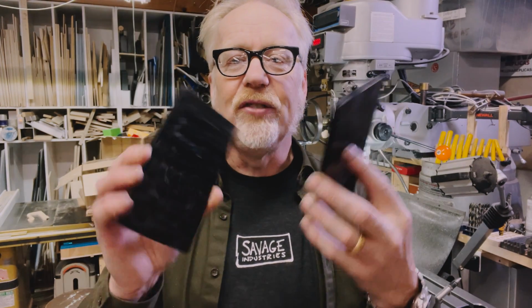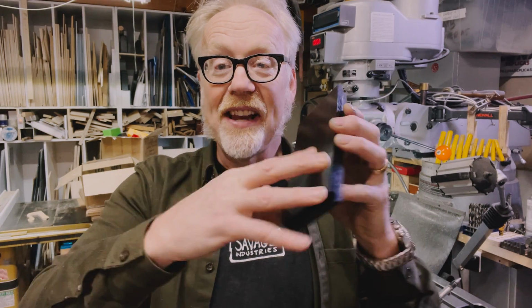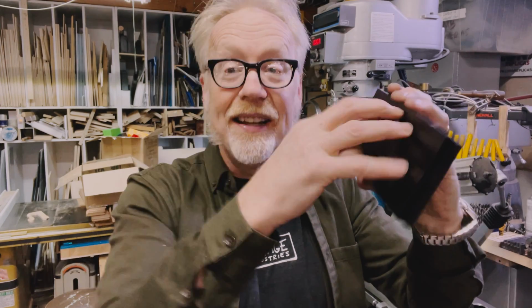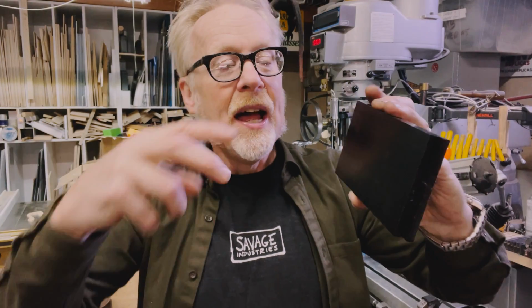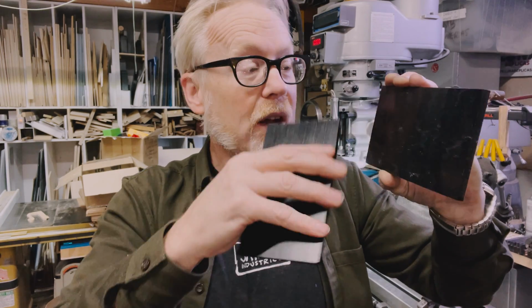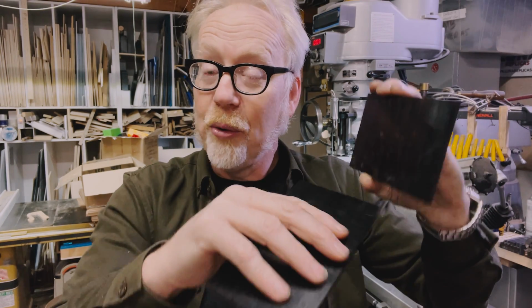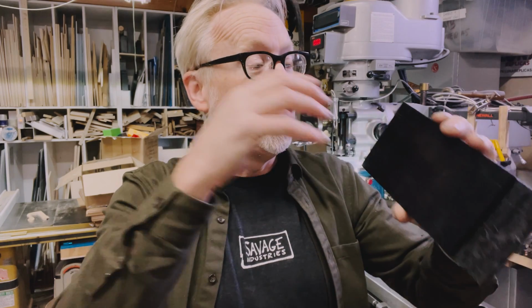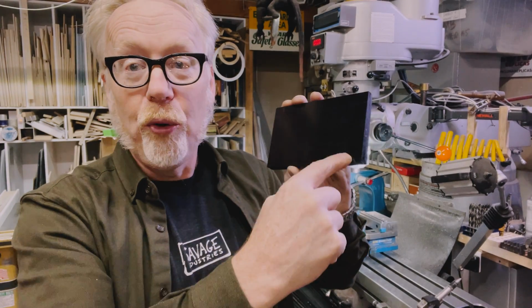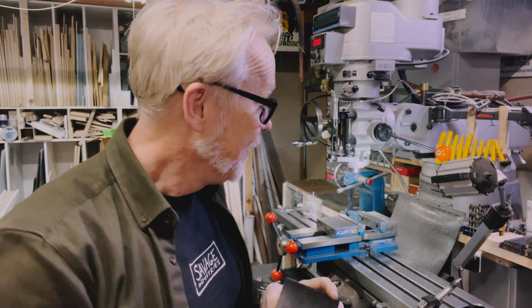Okay, so many times in engineering and building of things, I end up with a couple of plates that I want to be able to screw together. So let's say that this plate mounts to the wall or something, and then this plate mounts to the machine that I am building. And I want a set of registration holes between these two plates. So I'd have chamfered threaded holes in this plate, and through holes put in this plate. If I had to put eight holes around the perimeter of this, there are multiple tools that I need to do that.